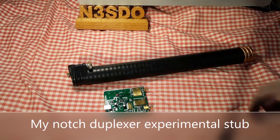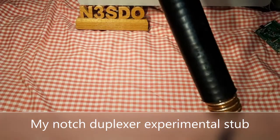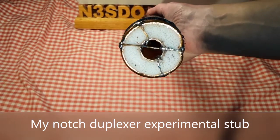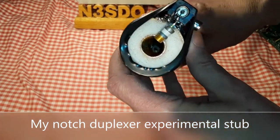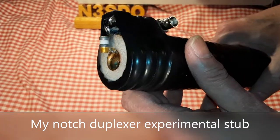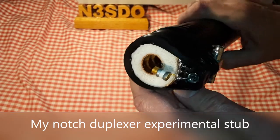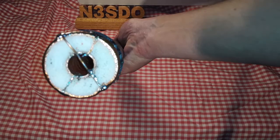Now let me move the D6 here and go over the stub. The stub is built from some scrap Heliax left over from a cellular tower. It was too short to be used for the 6 meter duplexers, but I figured I'd give it a shot — it might work for 2 meters, and either way it'd be good for some experiments. I cut the outer jacket away and used a big iron to solder some wires across the bottom and created a shorted quarter wave stub.